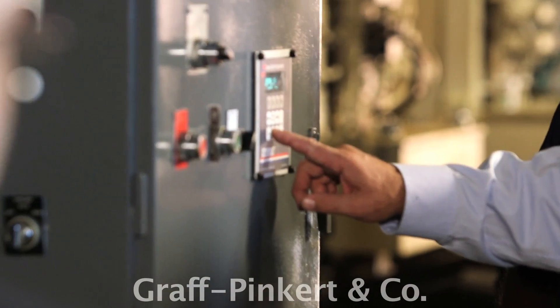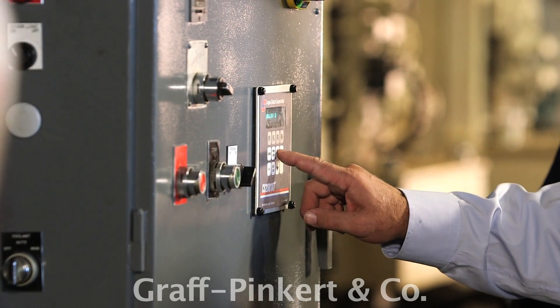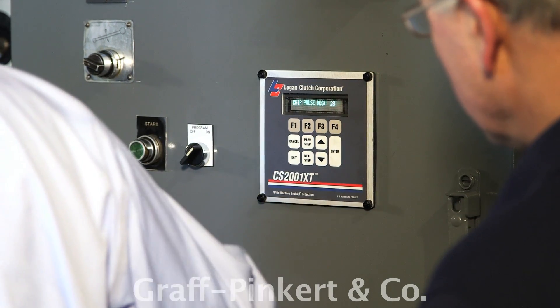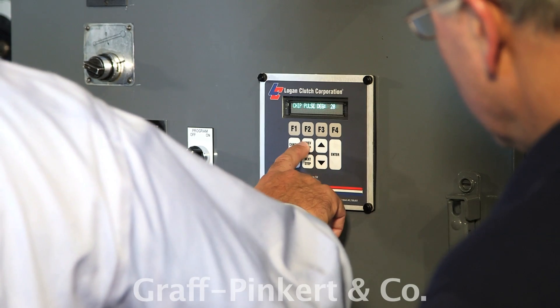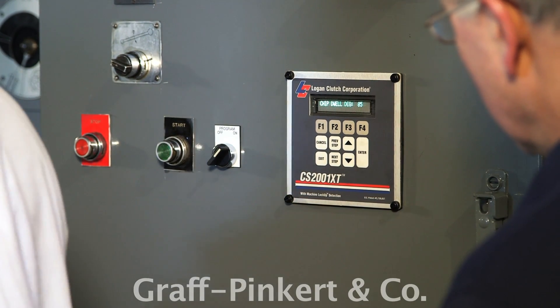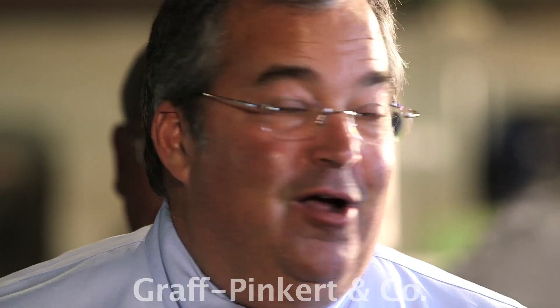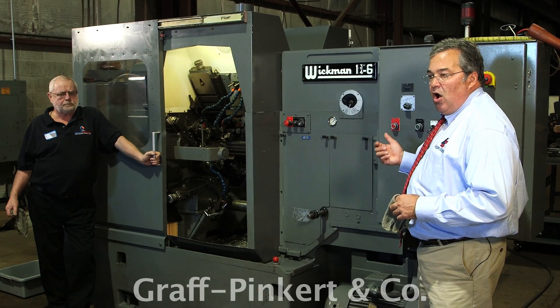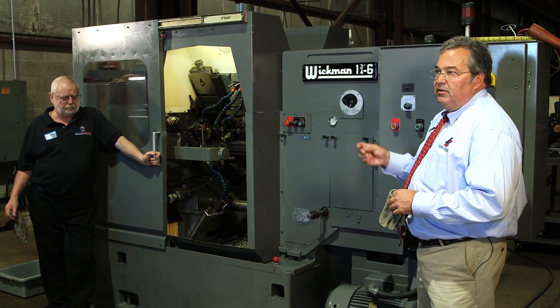Looking at the control settings: my dwell is in degrees, and I have 20 degrees of cam rotation where the thing feeds forward normally, and 5 degrees of dwell - which is enough to make the machine stop so the chip breaks off. It's totally adjustable, so every job might be different and different materials might be different. We took this job because it's obviously stringy material - it's a job you might not take because you couldn't run it well on a screw machine. All the other features still work: lockup detection, thread check - all those things are still functional inside the control and the machine itself.